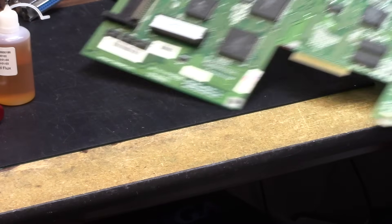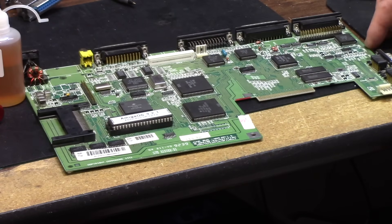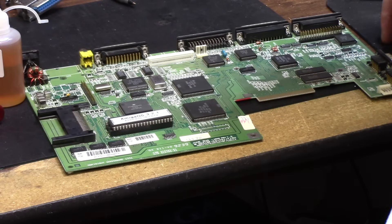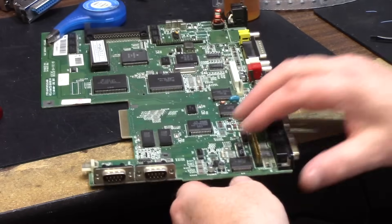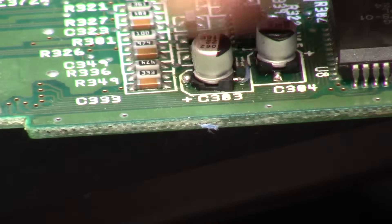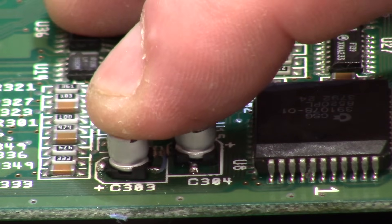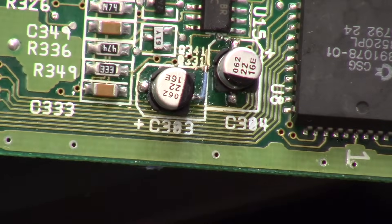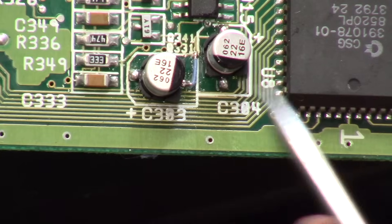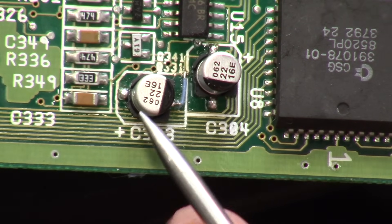I'm not going to bore you with the full recap. I'm going to do all this side first and then we'll go over here and show you how I fix the ground that bonds to the positive on C304 from C303. I'm going to epoxy this down — let me zoom in to show you. This cap is on straight. This one is a little wobbly because it's sitting up. There's the tiniest of wires — it runs to a little pad right there.